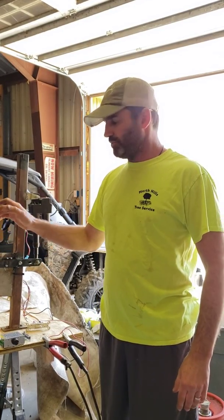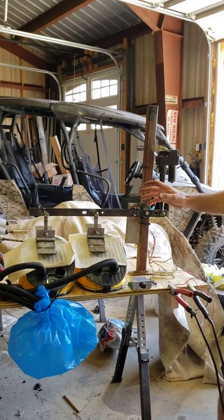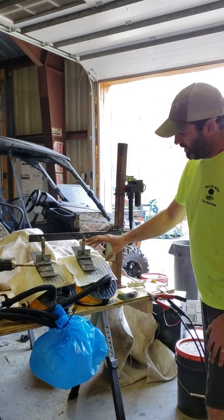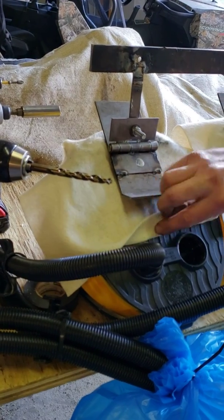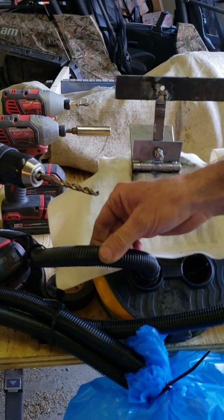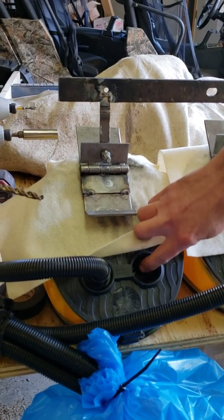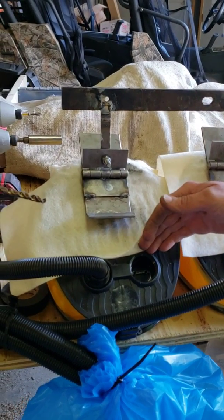With some ideas I put on paper last night and some research I did, within a couple of hours just in my garage I was able to build something that replicates what a ventilator does. To go over some of the parts: these are two raft inflators slash deflators. On a raft pump you work with your foot — you can see here this would be the inflate side, and they automatically come built with a deflate side. This costs less than ten dollars and automatically has a check valve in it.